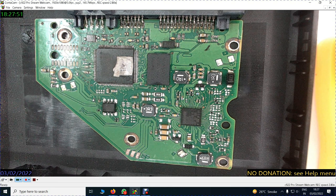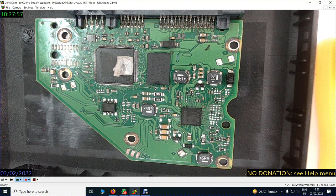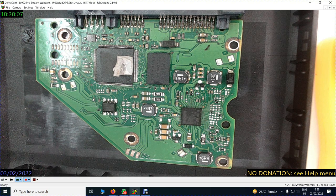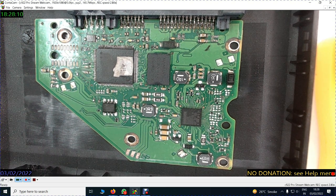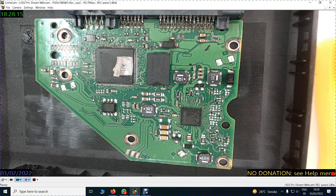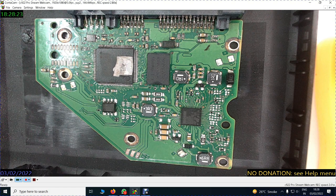Slowing down of current, not of speed. It just controls the current going into a hard disk. So it is clutch and brake of current, not the speed. The speed of the hard disk has to be constant. Now all the connections from here, after doing its job inside this, will go through here into these three pads. These three pads represent voltages going to the motor.